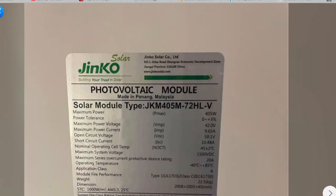I've got an old EP Solar charge controller — it's a 20 amp charge controller. I've had it for years; it sits in my shed and provides light to my shed, which is off-grid, for my lawnmower and that sort of thing. I'm not sure of the exact maximum voltage — I'd say around 50 to 60 volts — and that's how many volts it will take as input for charging a 12 volt battery. It takes that 50 volts and switches whatever it doesn't need — anything over 15 or 16 volts — and converts that into current or amperage.